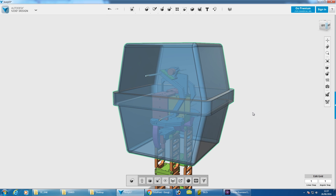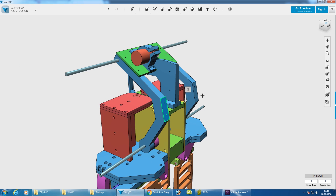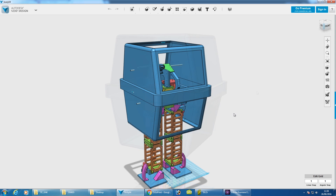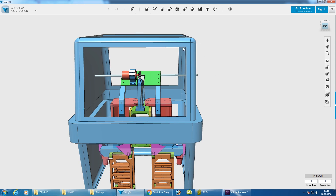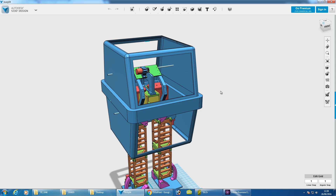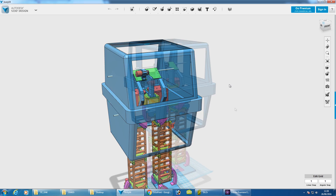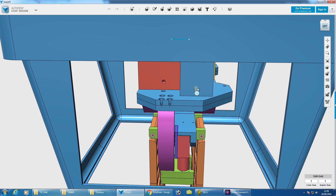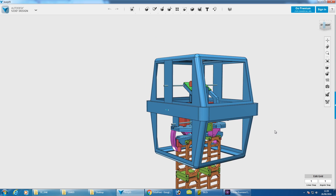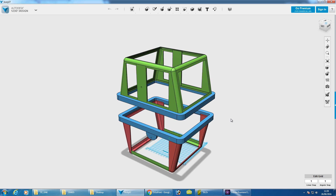The box is going to be a lightweight frame with removable panels. The battery will probably mount onto points at the front, with an additional bracket holding the main drive battery. Electronics will be mounted in panels just inside the box. I've started breaking out the panels, leaving a frame so we can fit a panel from behind or solvent weld things in. All my prints are ABS, so I can use acetone to make solvent welds. I've broken the frame into two parts, a bit like two shopping baskets, so we can start printing all the parts.